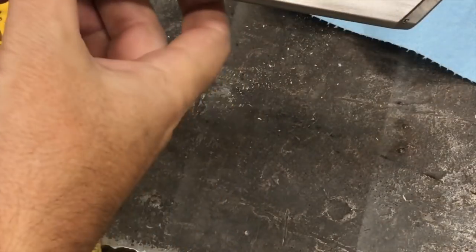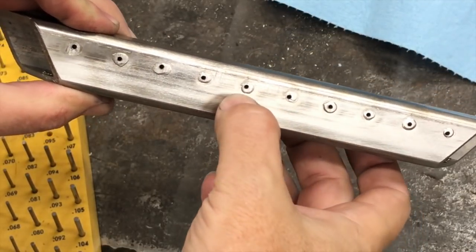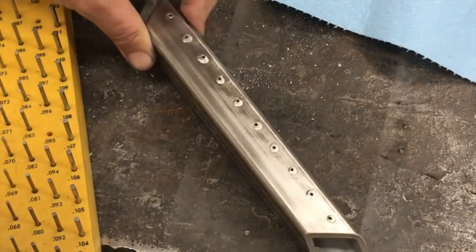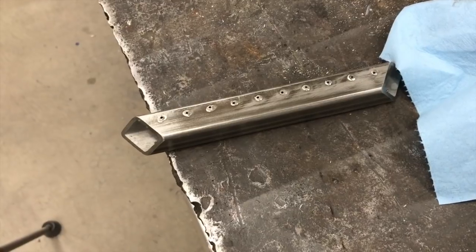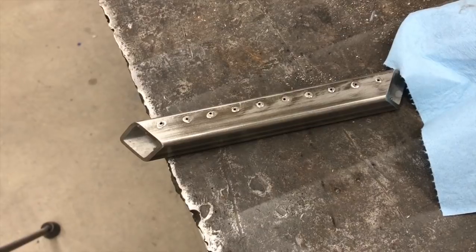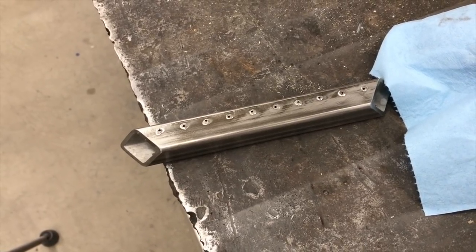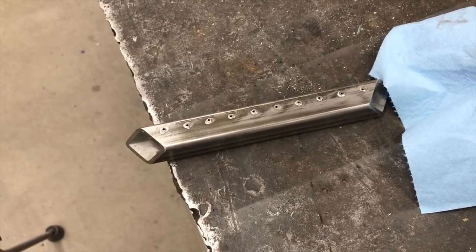There it is all finished up. The holes kind of look off-center from the weld, but they do hit the center of the marks — the marks are now gone since we're pretty much done with this part of the operation, but you saw the three steps. The purpose of the Inconel is that these things run at 3,500 degrees in a very abrasive environment, and that Inconel layer on top keeps those holes from growing and expanding out. Without it, they said just within a month or so of operation the holes start to open up. The Inconel makes them last a lot, lot longer.